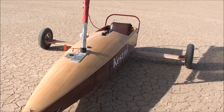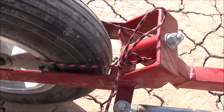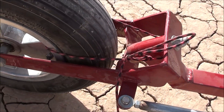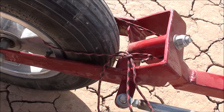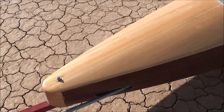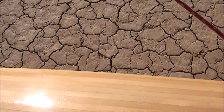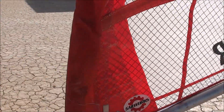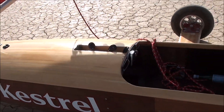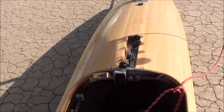When you leave your boat unattended, the first thing you want to do is get a lanyard and tie off the front wheel back to the forks so you can only roll so far. Also, unlace your main sheet so the sail can go all the way around 360 degrees and weather-vane in the wind. That way the boat won't be under any load or tip over — that's the beauty of an unstayed rig.